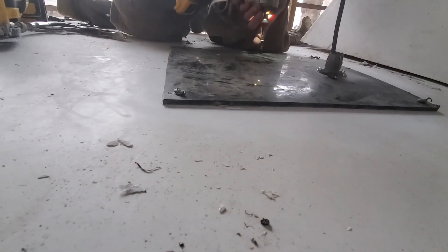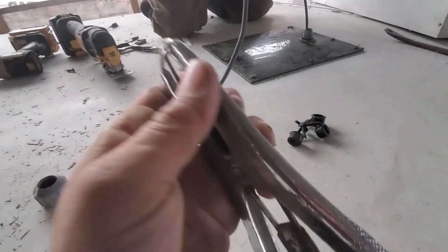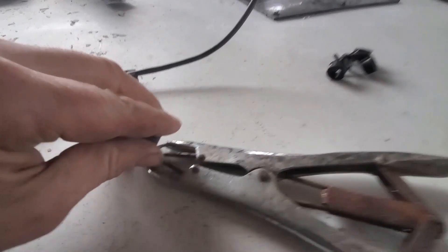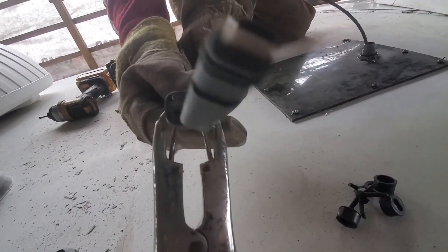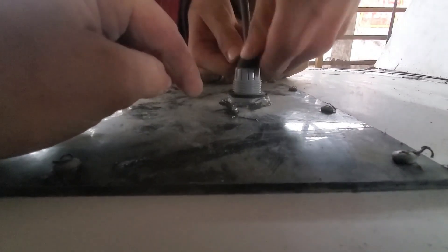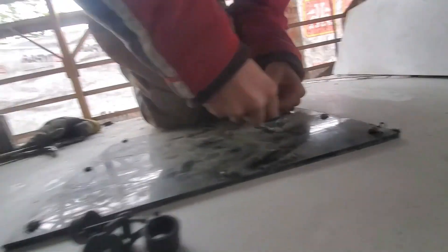Just don't over-tighten it — these roofs aren't exactly super thick. Now, this tool is highly recommended for your Starlink install. It's actually a tool for castrating cattle, but since I need to get this connector around this cable, I think it's going to work. The way it works: you take a little elastic and this tool spreads it so you can get it around — in this case, the Starlink cable. Now we can pull the cable through; the caulking isn't set yet. We're going to get it down as far as we can, then slip the nut on.